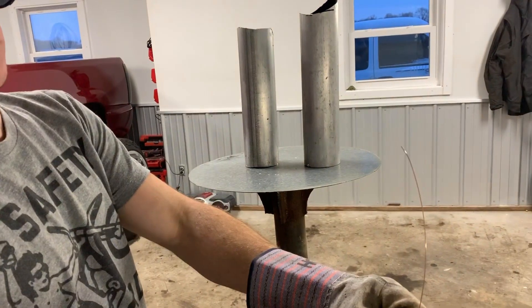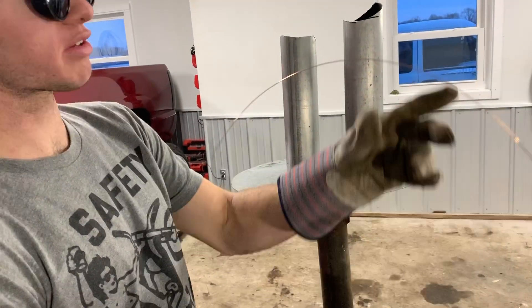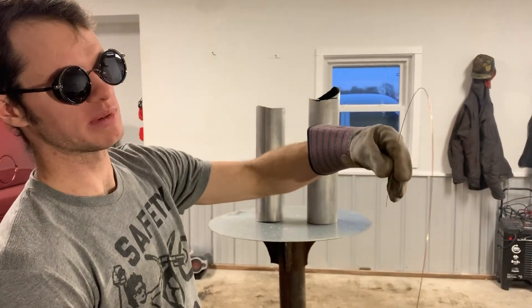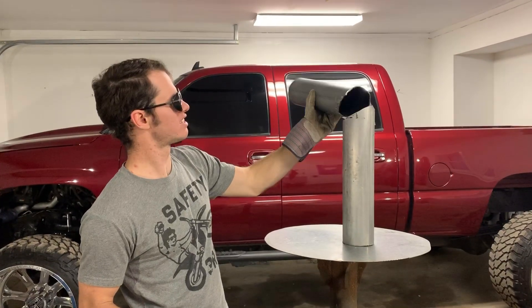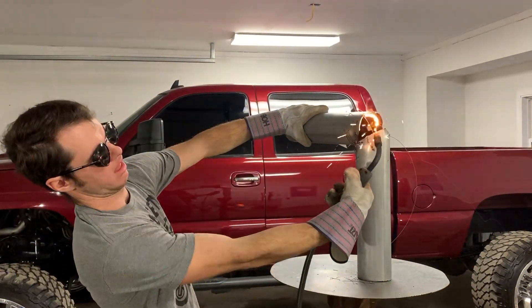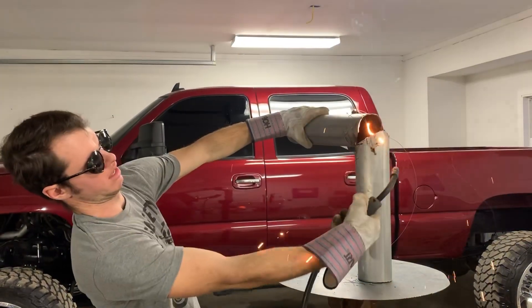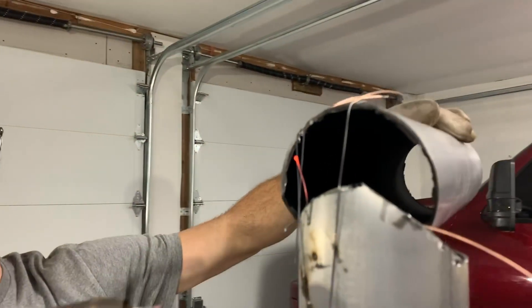The ground — as long as it's on the ground, what you want is as much distance as possible from your weld. I like to work with about this much wire, usually — two to three feet is what I like to work with. Just some really nice beads, stack of dimes, they call it. It's a 45. It's going to have to go like this. We can fill that in if we had to. You can see now the wire — you can patch it in sort of like a plaster.